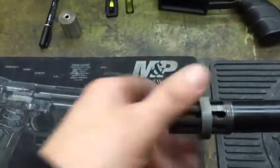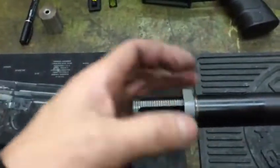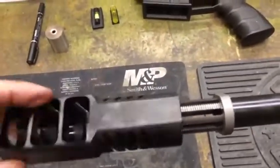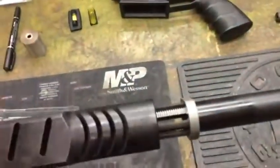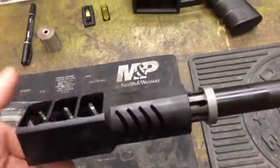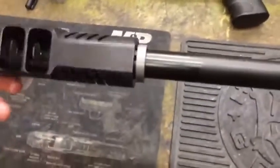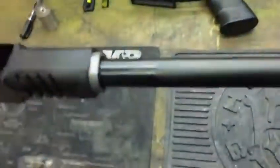You run down the external thread with the new locking nut, and that's stainless steel right now. Obviously we're going to have to Cerakote that black before we send this back to the customer. Now we can screw the muzzle brake onto the constructed adapter, and it also means the customer will be able to remove the muzzle brake for cleaning the shotgun — because had we threadlocked and permanently mounted the muzzle brake it would be incredibly difficult for the customer to clean the shotgun.